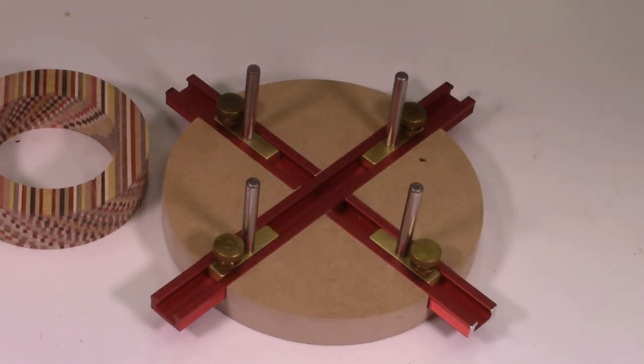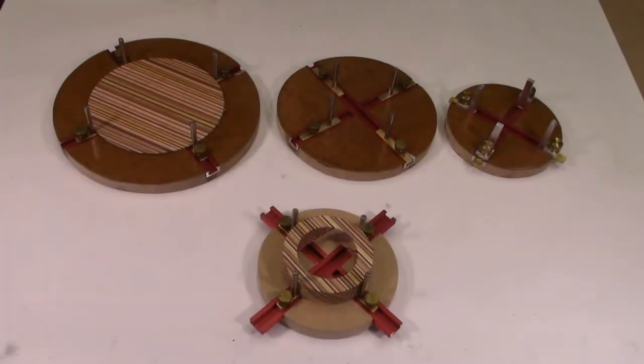A fourth and final video will demonstrate how these jigs are used to glue up the laminate discs for the Dizzy Bowl projects, and how these same jigs can be used to glue up multiple layers of segmented discs for segmented disc projects. The glue-up jigs are made from three-quarter-inch round MDF discs with slots cut into the surface for the insertion of aluminum T-channel inserts. I made three sizes of discs to enable gluing up of laminate discs from 2 inches up to 10 inches in diameter.